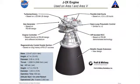This is the engine — this is the J2X. Every system on there, although it has heritage in the J2, is built with new materials and new processes. The nozzle is a big challenge. That is a 92-to-1 expansion ratio — tremendous. We initially looked at using composites, but found that in that application we could do it with a metallic nozzle for almost exactly the same mass within a few pounds. We thought it lower risk, so that's why we went that way.